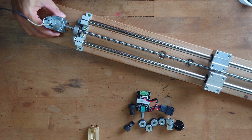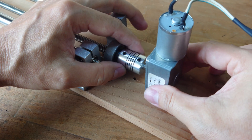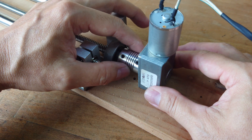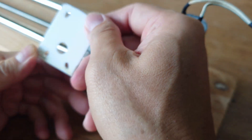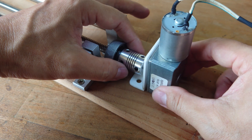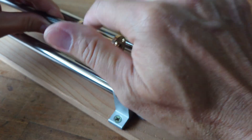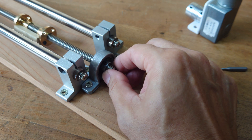Make sure the motor is aligned in height with the shaft. Now install the coupling. Test that the wheel is parallel - nice and smooth, no resistance, and it spins smoothly. I made an acrylic bracket to hold the motor. Don't tighten just yet - just test the position. Remember to test everything before we tighten all the screws.